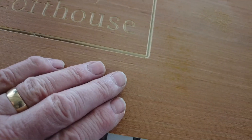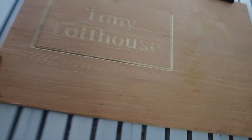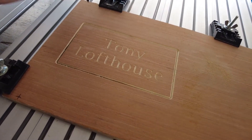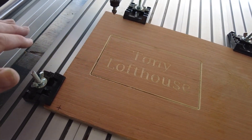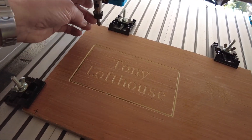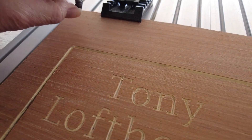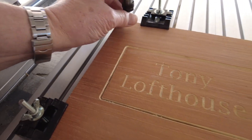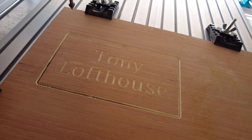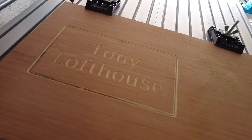It's very good. I haven't cleaned it, I haven't sanded it — all I have done is vac it. The spindle is not a particularly expensive spindle; it's a cheap Chinese 500-watt spindle supposed to produce 12,000 RPM and it produces 11,500 — so you are 500 short. The cutter is a cheap Chinese cutter too, and it's not particularly good. But it's done that: 1500 millimetres per minute at 11,500 RPM with a 60-degree V-bit — and that's the finish.